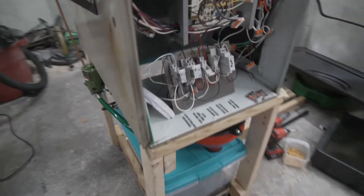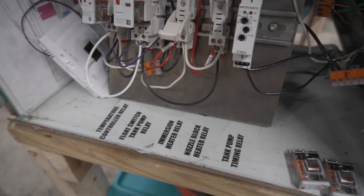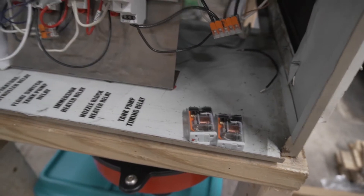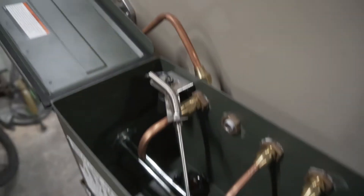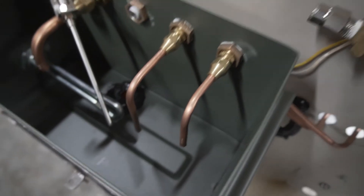We're about ready to prime this. I have inline relays all labeled — I'll possibly do a more in-depth video on how I wired it up. The last two relays are for my heaters: one in the siphon tank on the side and one inside the actual burner itself. For now those two relays are popped off, so the only thing running should be the pump, which will pump oil up through an inline oil filter housing and feed it down into the siphon tank where I've got a hot water heater element.